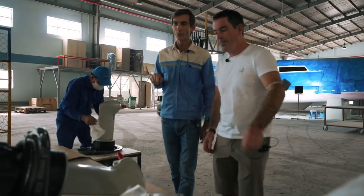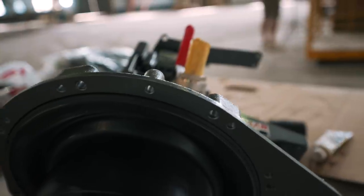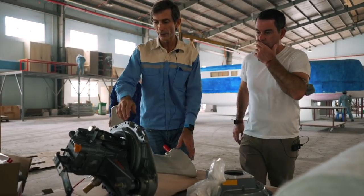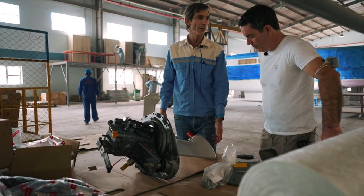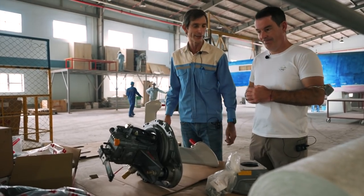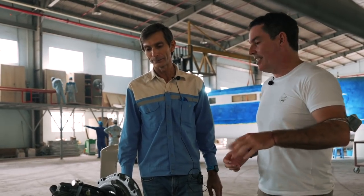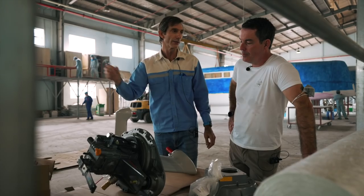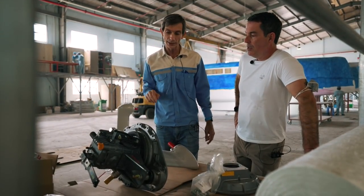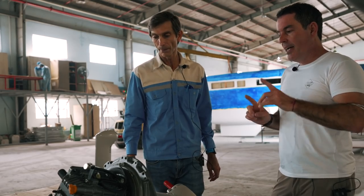This is called the SD60 model — the same unit for both the 40 horsepower and the 57 horsepower. The engine changes, obviously the ratio and the leg length, but they're customized for that combination. Yanmar has made improvements in recent years — oil changing in the gearbox used to be a horrible job because you had to drain from the bottom, which meant hauling out. That's expensive, plus salt water, stainless steel screw, aluminium drive leg — if you don't maintain it properly it seizes.